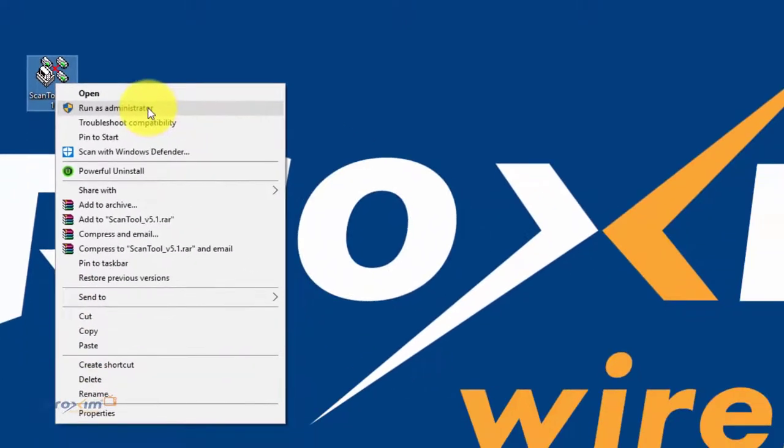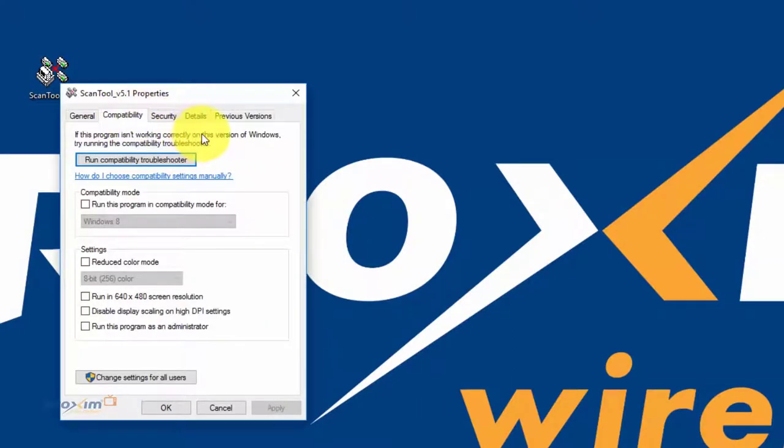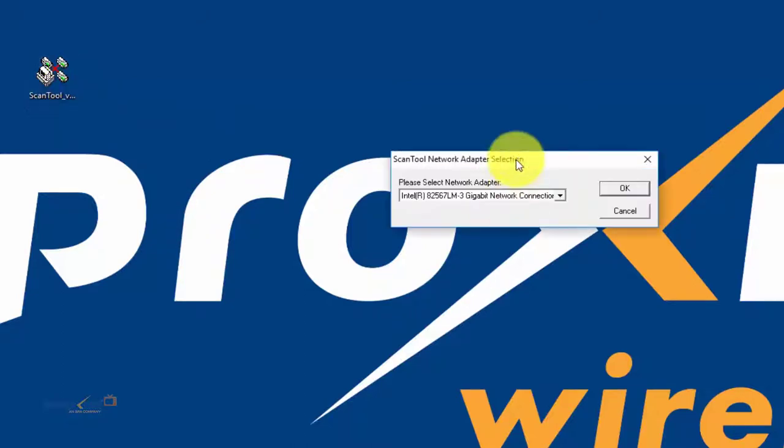All right, one last bit. You have to be in administrator mode for the reset reload function to work. So I guess there's two ways you could do it. You could right click and then just go to run as admin. What I do is I just go to properties, go down to compatibility, and just go ahead and do run this program as administrator. Applying, okay, so that way you don't have to go through that right click all the time. So now when you press on it, you're going to get this, and here we are. Go ahead and select your NIC, your IP address, the 133, and click okay.